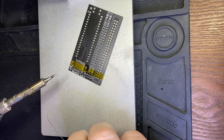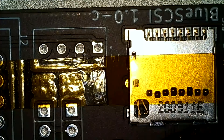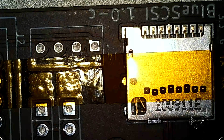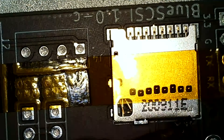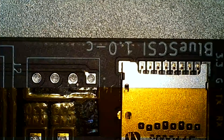As you can see, this is how you attach the Kapton Tape. Here is a close-up image of the Kapton Tape and the SD card slot where it should be. I'm going to hit each one of the pads that anchors the SD card slot down. Let me adjust it in place and I will start from this corner right here. As you can see I'm hitting it with the iron and the solder just goes in as I'm attaching it. Then we will move on to the next leg. Now I have attached all of the supports.